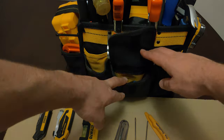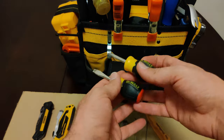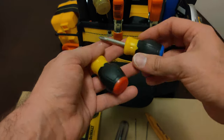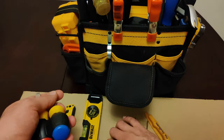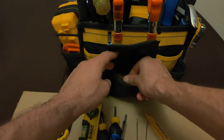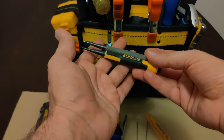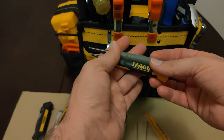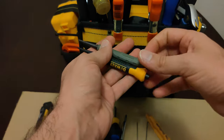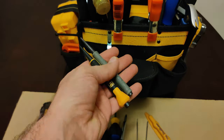We got a little pouch here with a flap on top, and inside I carry little stubby screwdrivers. They basically fit in tight spaces — they're very short compared to a regular screwdriver — and whenever you try to unscrew something in a very tight space that you cannot fit a large one into, this is what you go for. In the same pocket we've also got a couple of punch tools, called center punches. You use them to mark points right before you drill into something — you center punch it and create a little recess so that when you're drilling your drill doesn't slide around, making your job a lot easier and more accurate.